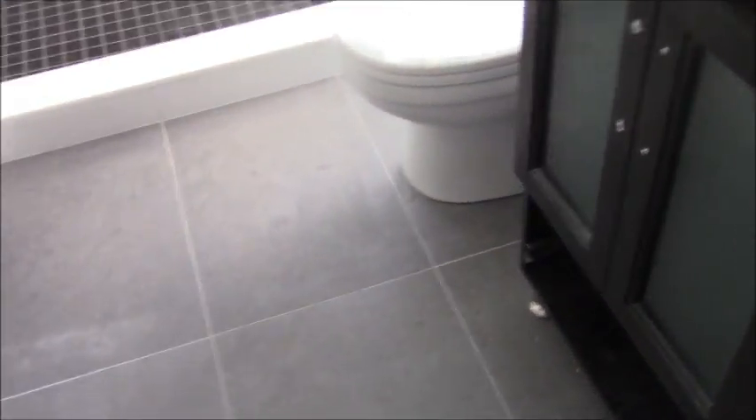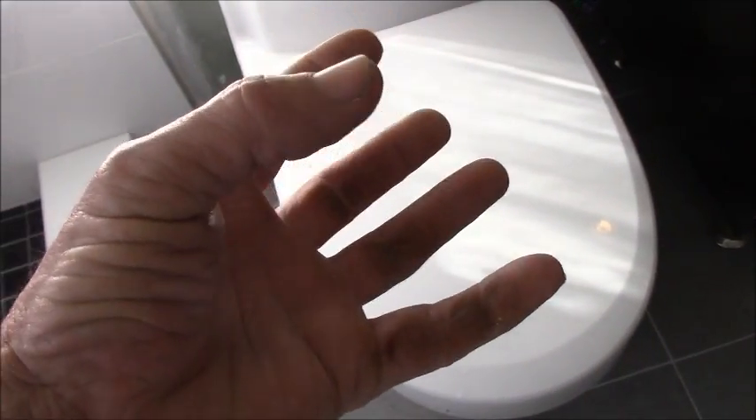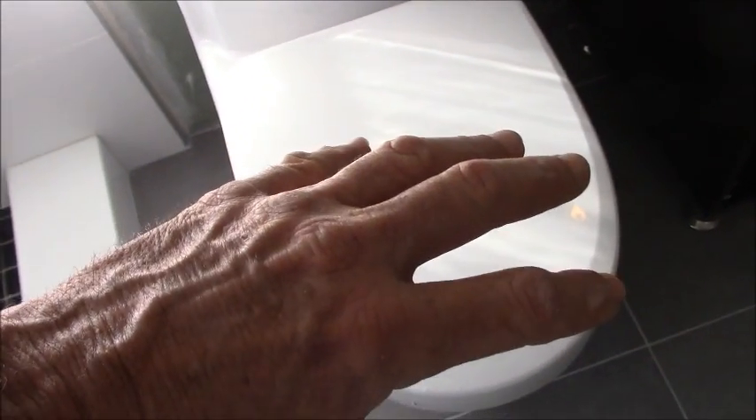The toilet is brand new — it's a low-flow toilet. What I like about these toilets is that there's a flange underneath and the toilet sets to the floor. That flange goes onto the wax ring, but the wax ring is actually flipped upside down and goes on top of it. It has a little trough — for lack of a better term — and a pipe in the back that goes up, and then the back of the toilet sets down inside of that pipe.